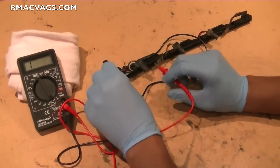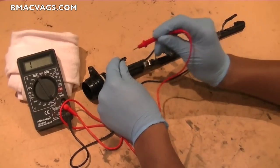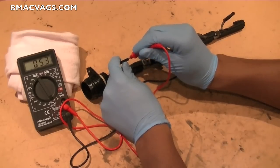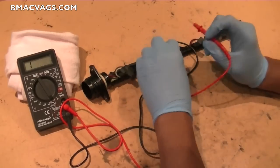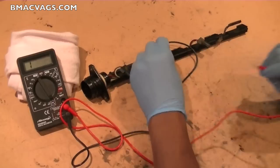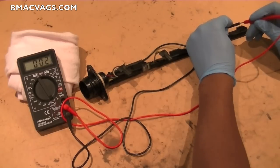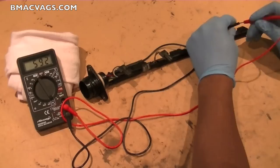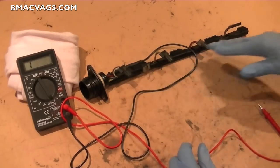Now our next job is just one by one to check each one of these connections on the brown wire to make sure we're getting some sort of voltage. Wait for it to settle down because any little movement can affect it — it's quite sensitive. You can hear we've got continuity there. Same thing on each one. Sometimes my movement will affect it, but we've now checked the main feed is the same all the way through.